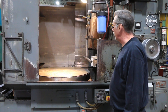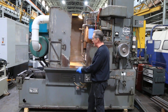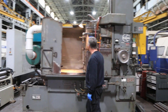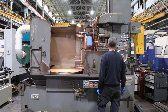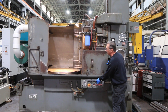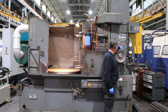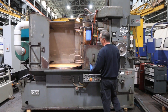Table in and out works as it should. Table stops you set correctly — they have the table out stop set pretty far out, which makes it easier to get your parts off the machine. It also has a rapid up and down for your head. The chuck should be running while you're doing that, because running the chuck is what spins the gearbox and sends the oil up into your feed down unit to lubricate everything. You always want to have the chuck running when you run the head up and down.